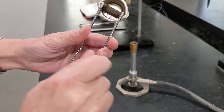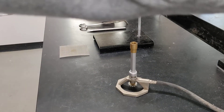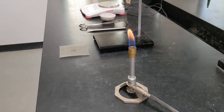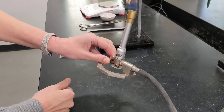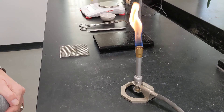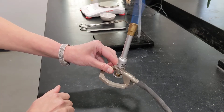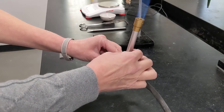To begin with, I'm going to close the barrel all the way down so that not much oxygen enters the flame — this gives a flame that's not burning too hot, called the safety flame. To light the burner I'll use this sparker, which has a little piece of flint rubbing against a file to create a spark. I turn on the gas, lean back so my face is not over the burner, and squeeze — and there you go, the burner is lit. That's called a safety flame because it's easy to see, so no one will accidentally not know the burner is running.